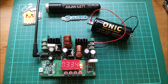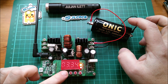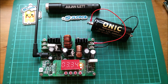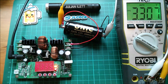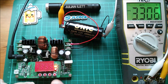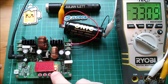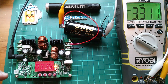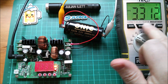We can see it's connected; current is one amp — that should be about fine. We're seeing 3.34V now, but with one amp in these wires it's likely the cell voltage is slightly lower than 3.34. Let's get a DMM on there — the cell is at 3.30V, while the converter is saying 3.35V, because there's a little bit of voltage drop in the cable. The current is on exactly one amp.